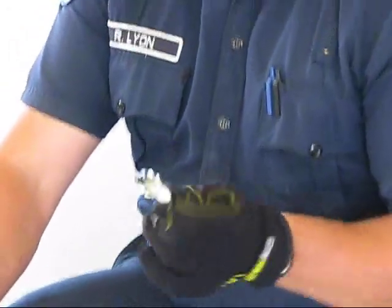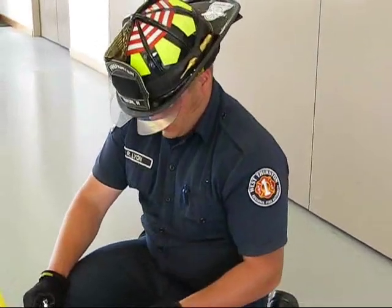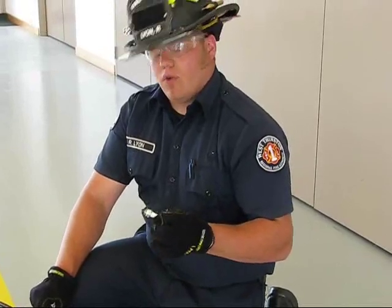Check to ensure that your plug isn't fouled. Fouled means that it's usually loaded full of fuel and unburnt carbon. It's okay for them to be a little bit black because these do run and burn a lot of oil when you run them.